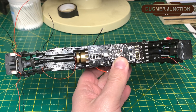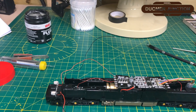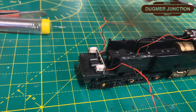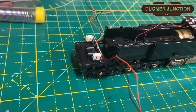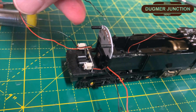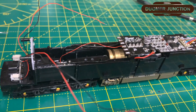So there's a quick summary — I'm going to go off camera and get this all wired up. Very quickly before I do, I almost forgot: you've also got to put the back cab plates in at this stage. If you move the lighting wires out of the way, they go in these little grooves like so. And then you feed those through the channels there and back out the other side — you do that on both sides. And then obviously you can wire up to your tabs or solder onto your tabs.